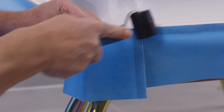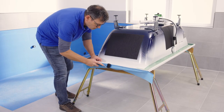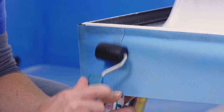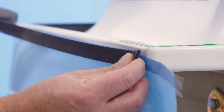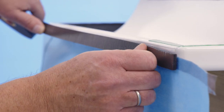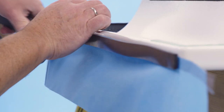Run the enclosed roller over all the adhesive surfaces. Our sealing system for baths contains all the items that you need — both for the bath shown here with the conventional bathroom border of greater than or equal to 15 mm, and for our baths with folded edges. Finally, apply the bath divider, which you will also find in our sealing set.